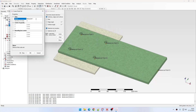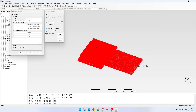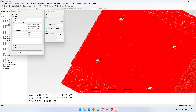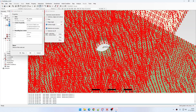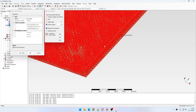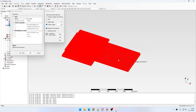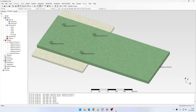I need another node set named BC Hole, applied to the entire plates except for the hole regions. I'll unselect the hole regions to avoid over-constraint, because I will apply rigid body constraints to those nodes. I also need to leave out one face that will have its own rigid body constraint — that also needs to be excluded from this node set.